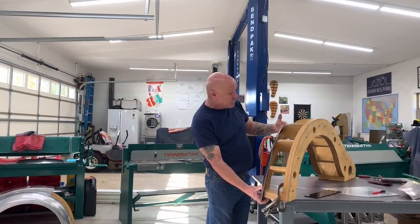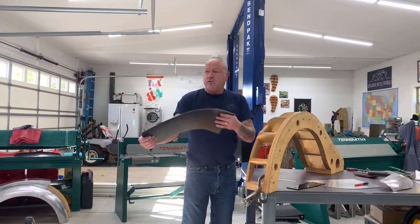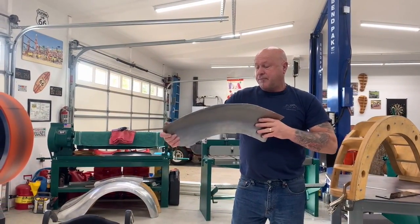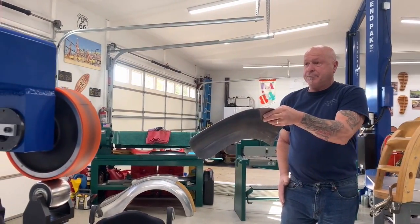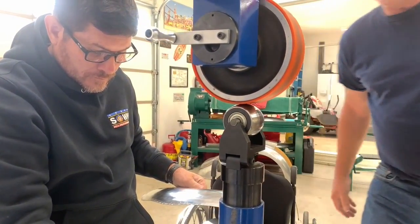And it's touching on this end on the buck. We don't have a rock. What we have is a very, very slight twist. So we just take care of the twist by twisting and flexing our panel to bring that in nice and uniform all the way through again. So let's feel how we do it. You can probably up your pressure a little bit.